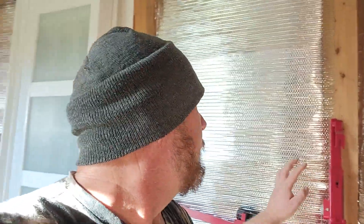Human breathing is wet heat too. Six guys staying the night in a shipping container — I bet you would end up with container moisture if it wasn't insulated. A lot of people use spray foam to put that barrier between the metal so it simply can't condense. I didn't for two reasons. One, I'm trying to build a thousand-year home, and my experience with spray foam is that even the closed cell stuff, if it gets wet, it wicks the moisture into it and you get a mold problem. I used mineral wool instead, and three-quarter inch drywall, and the foil behind me — and it wasn't enough. Without it pressed against the wall, it still allowed moisture air to circulate. So the drywall and the flooring to seal it is obviously super necessary.